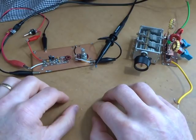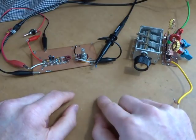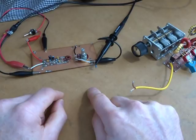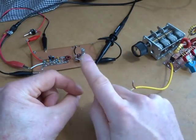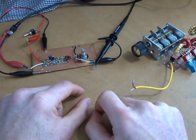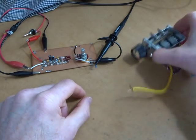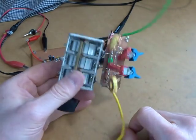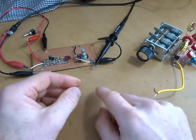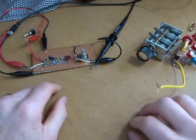Okay, I'll say 73s there. I think I've yabbered on long enough. Hopefully around these upcoming trips I'll be able to get back into the shack. Next steps will be to clean this up, join them together, and have that RF splitter to split the RF between the in-phase and quadrature circuits, then start looking at those two SBL-1 mixers. Noting that the SBL-1s want to see 50 ohms on all ports, I may need a 50 ohm pad on the output to help them see 50 ohms — but we'll play around and see what happens. 73s, take care and see you next time.